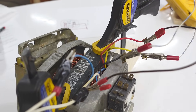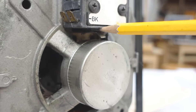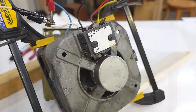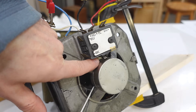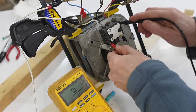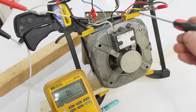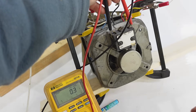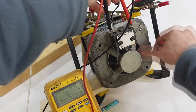We should disconnect that starter winding as soon as the motor gets up to speed, and that's what this centrifugally activated switch is for — it gets activated from this little lever here which goes to a centrifugal arrangement. Once it's up to speed, this thing moves. I can also activate this centrifugal switch just with a screwdriver. If I push that tab, it moves away. I need to figure out what connection in this switch disengages when I move it. These are double tabs — the only thing that connects beyond that is this to this. Reading 0.2 ohms — basically a dead short. If I hit that centrifugal switch, that opens up.